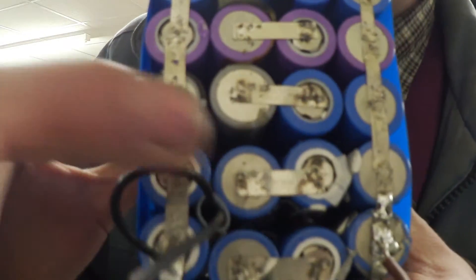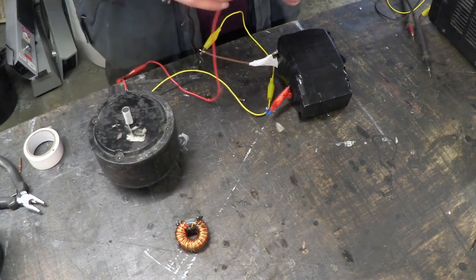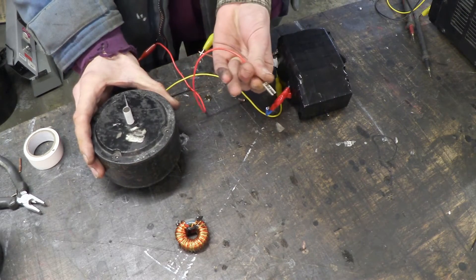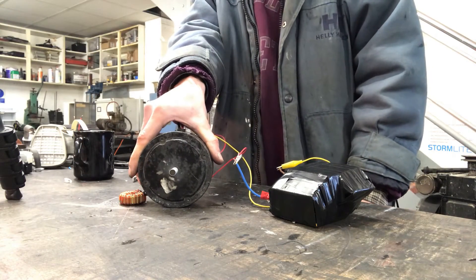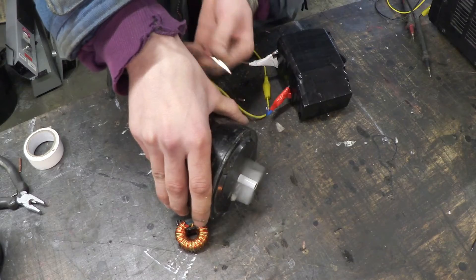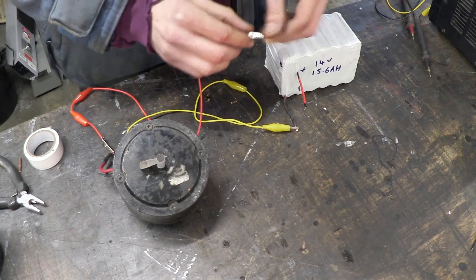Here is a close-up of the positioning of the thermal cutout switch. The first pack we're going to try is this flat lithium-ion one, and I've got this nice little 12 volt motor right here just to make sure that it runs. So let's connect that up. And there you go. Now I've got the same setup but on the 18650 pack — all we're going to do is connect it up the same way and just make sure that this motor runs.